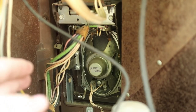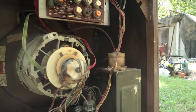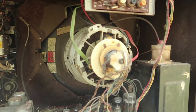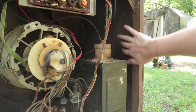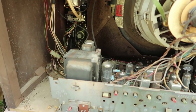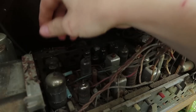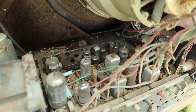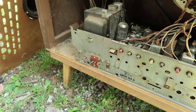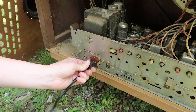The speaker looks like it's in surprisingly good condition, which is great — if this television had gotten wet, that speaker cone probably would have disintegrated. One thing I'm a bit disappointed about is that usually there's a big schematic on the inside of this older stuff with the model number and all that information, but I don't see it here. I'll wiggle the tubes to make sure they have a good connection since they probably broke connection over the years. I also found a local thrift shop has a plug that almost fits — I can kind of squeeze it on there, which saves me having to make one.